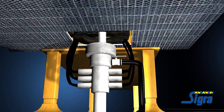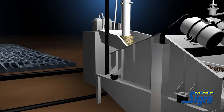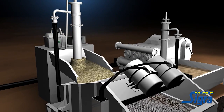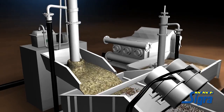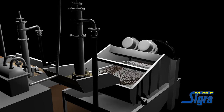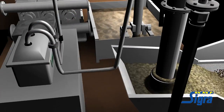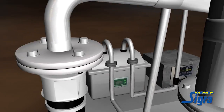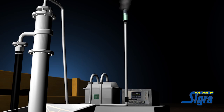At the top of the BOP stack, a rotary seal is fitted so that all the fluid and cuttings are diverted to a cyclonic separator with a wet poor-boy base. In the cyclone, mud and cuttings swirl down inside the separator and then into the wet base and overflow to a shaker. The gas rises inside the cyclone and its volume is measured by positive displacement flow meters. The gas is further analyzed for its composition before it's discharged to the atmosphere.